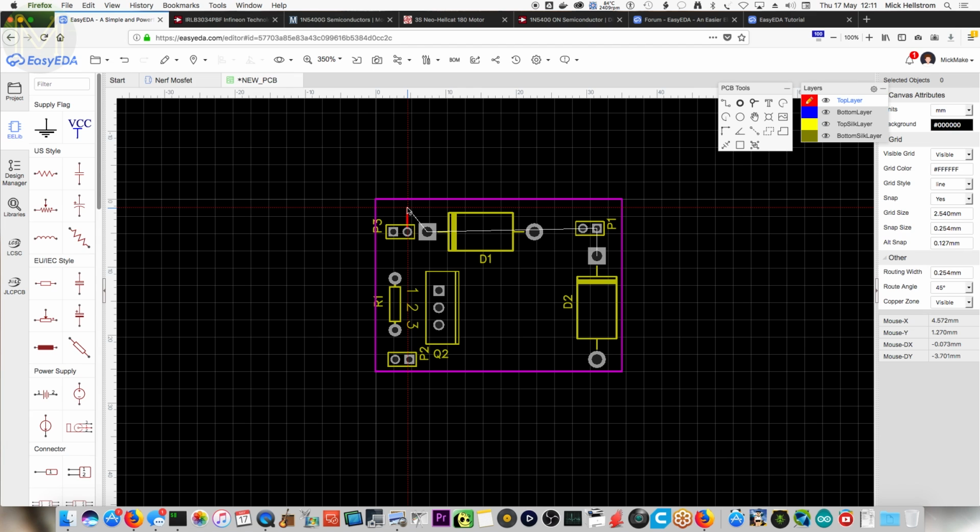Okay. Is there like an amperage rating for a piece of copper track? Well, it depends on the ounce. PCBs are usually 1 ounce copper. You can get 2 ounce, which is twice as thick. But I'd make that track as thick as you possibly can. 0.5 millimeters, that's tiny. Okay, so change it to try 2. Yeah, look at that, 2 millimeter.